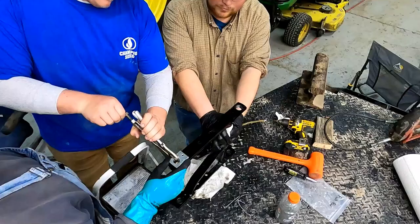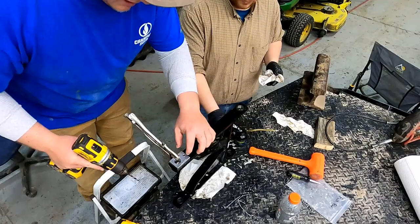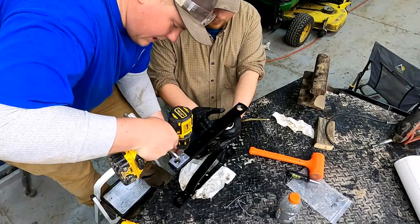There we go. So we're using two drills. This one's a 25/64. This one's a 3/16, right? And this here is like the guide, you gotta start a little pilot hole here. So yesterday I was just drilling all the way through, but I think I'm going to pull it back off and then free drill it, because that worked a little bit better.